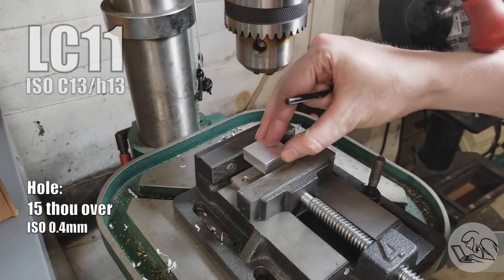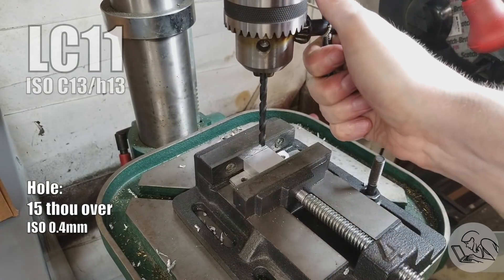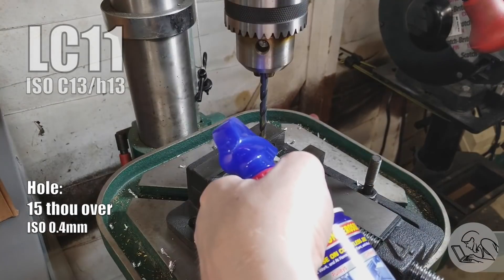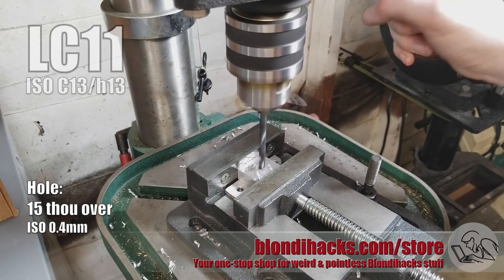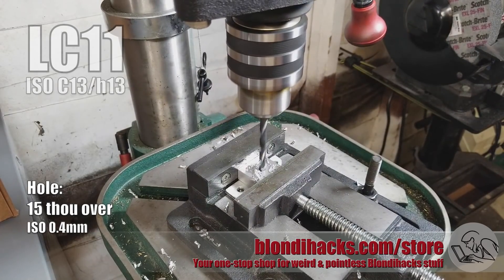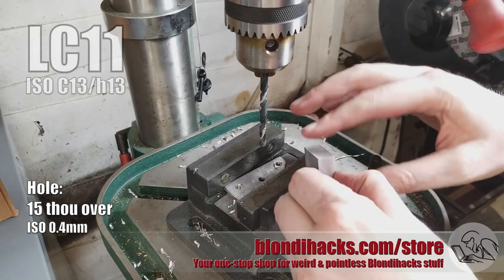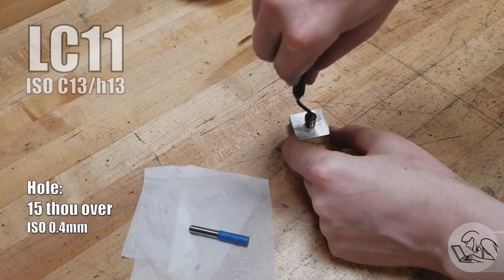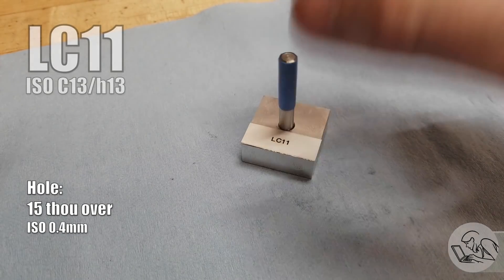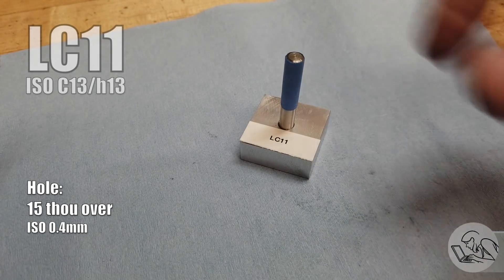Starting with LC11. LC11 is great for large-scale fabrication when you've got a lot of parts that may not be perfectly straight or might be warped from welding, and you want to make sure bolt holes are all going to line up. This is the type of clearance you'd encounter when bolting together parts for a workbench. It can be easily achieved on a drill press with no effort at all, and it's also achievable with forming and extrusion processes. Here's our test pin in an LC11 hole — you can see lots and lots of slop, pin just falls right through. It's like a generous clearance hole on a bolt.